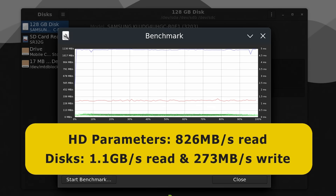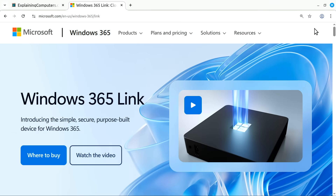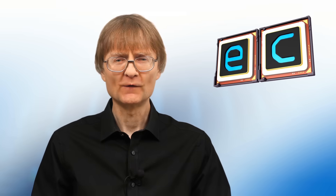UFS has only just started to arrive on ARM SBCs, and on the ROC 4D, whilst performance is clearly better than eMMC and most NVMe SSD implementations, we are clearly some distance from harnessing the full speed of the technology. Nevertheless, UFS has the potential to transform SBC storage, reversing the trend towards NVMe SSDs. And if you're wondering about x86 mini PCs, UFS is starting to appear on these too, including Microsoft's new 365 Link Cloud PC. If you've enjoyed what you've seen here, please press like and subscribe.